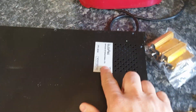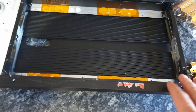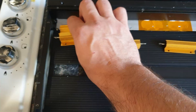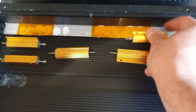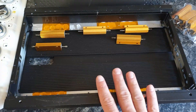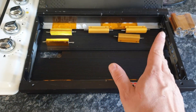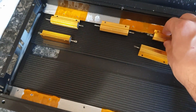This was kindly donated by James — thank you very much, James. It's an old In Phase amplifier that I took the guts out of. I sent the guts to Sam for spare parts, and for this I was going to drill and tap the actual heatsink. I need to figure out how to rearrange the resistors, and basically I'm going to have a static load bank with maybe some connectors on the end plate. I haven't figured it out yet, but I can do various combinations — 2 ohms, 4 ohms, whatever — and this is going to be perfect for sinking all the heat.